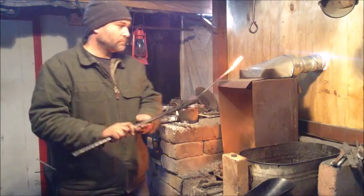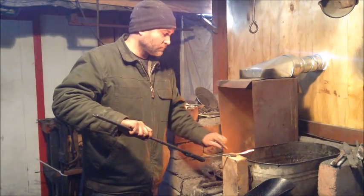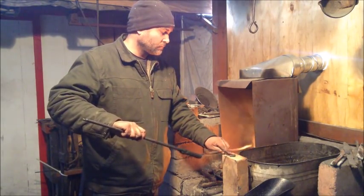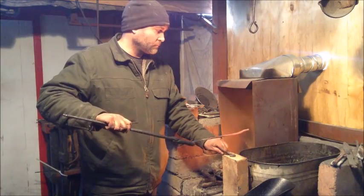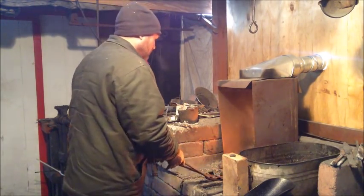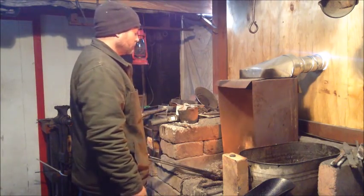To begin, we need to heat our steel. Steel itself can exist in several different states or phases. We'll keep it simple and say the steel is in a ferritic state. It needs to be heated to a point where austenite forms, and with most common steels, this is above 1,340 degrees Fahrenheit. A simple test is to take a magnet and place the heated steel on it, as austenite is non-magnetic. Once our steel hits its temperature, it's allowed to soak to ensure a uniform transformation.